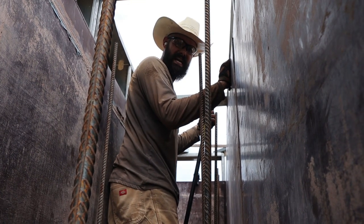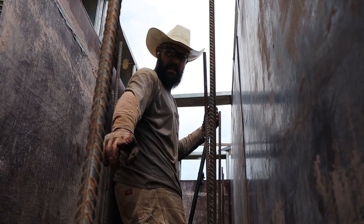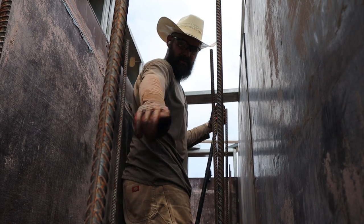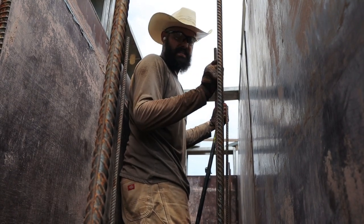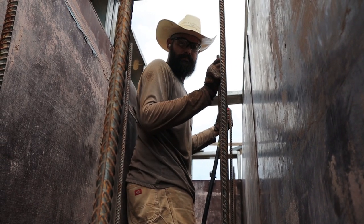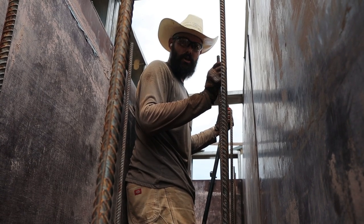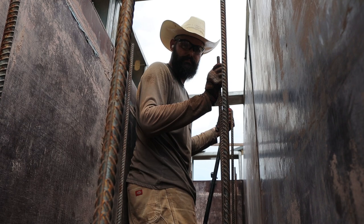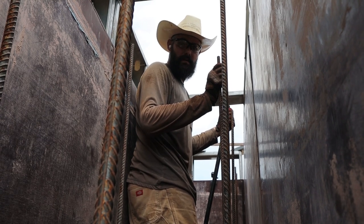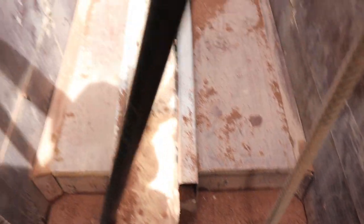I'll try not to cover it and then do one more lift. If we do two more lifts, that'll get us to the top of the foam and this piece, because I don't think we have time to do another piece of foam and form. But that's where rebar is supposed to go — we can't do rebar in a cold joint, so we'll just skip that rebar. This is what it looks like — we've got a little bit more to go before the window is covered.